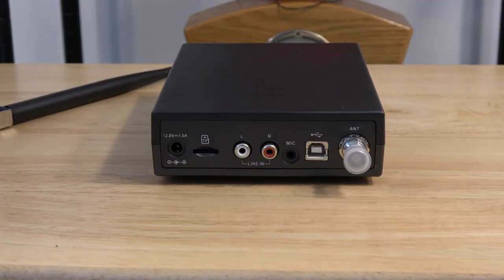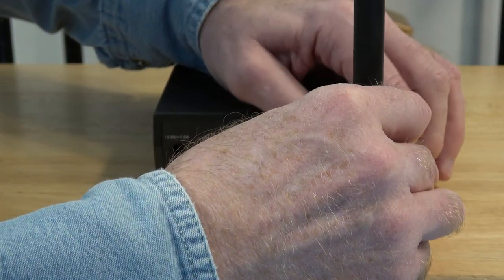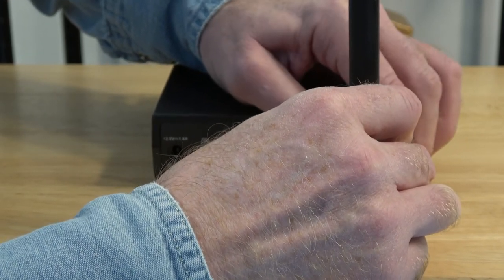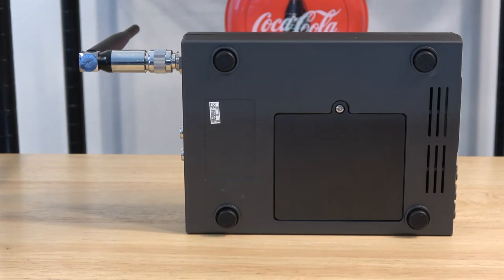According to the instructions, the first thing to do is attach the antenna — it says don't power on this without an antenna, because it will destroy the transmitter. That makes sense because it's trying to send power out and there's no place for it to go without the antenna. The bottom cover exposes the rechargeable battery pack, which should last approximately four hours of transmission time, though that depends on the age of the battery and the wattage you're transmitting at.